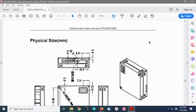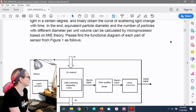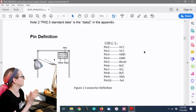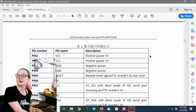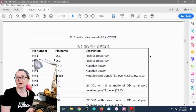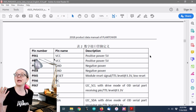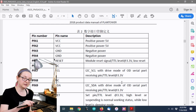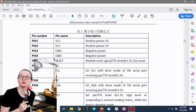Let's go to the computer and look at the datasheet for this sensor. I asked the company for a datasheet and they sent one — it has a lot of information about technical specifications, and here's the connector info showing the pinout. That's really handy, but it doesn't tell me what the connector actually is. Sometimes if you're lucky, or you have a good supplier, they'll tell you a Molex part number or Amphenol part number to match. In this case I get no information at all — all I can see is it's 10 pins. So we're going to use calipers — which you can pick up at DigiKey by the way — to measure the pitch.